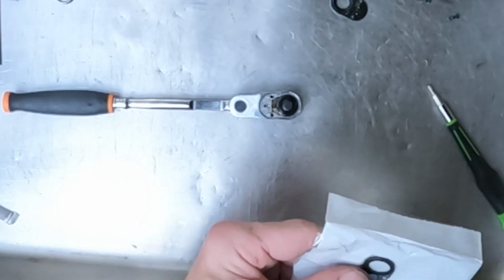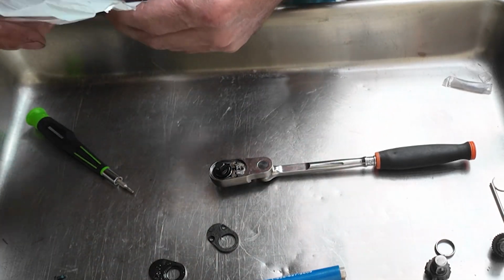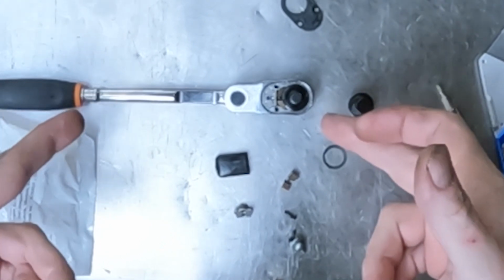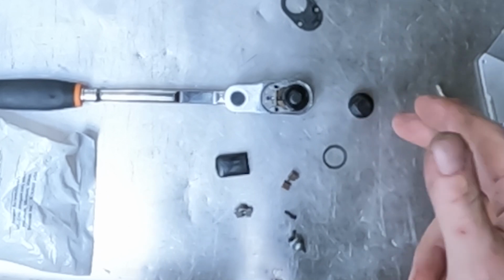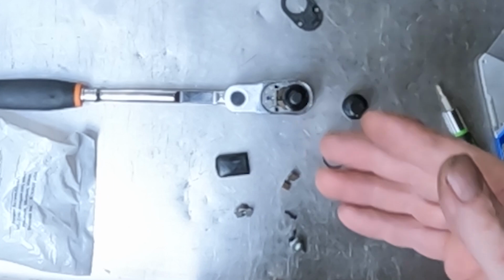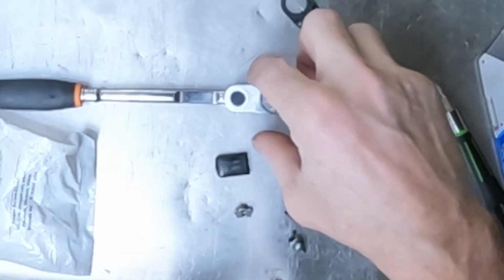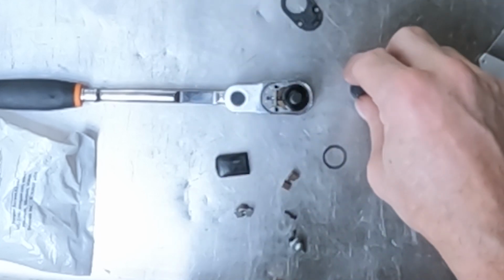So what I'm going to do here is show you the 3/8 plate. And here are all the parts for this 3/8 drive kit. So basically what I want to talk about here is this quarter drive is what Snap-on calls the T72. This is going to be called the F72. So I've seen a bunch of these get done where people get in here, they gut the whole tool just to put the same exact parts back in the tool. Okay, so if you were an engineer and all you were doing was changing the head, wouldn't you just change the head, right? The anvil.